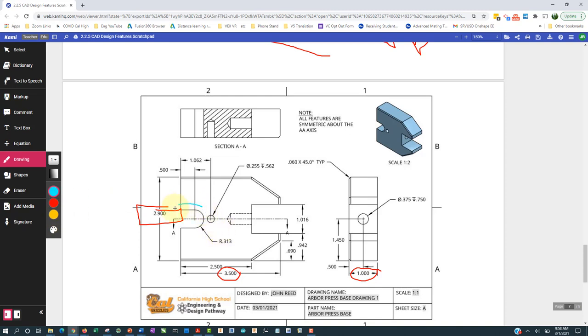I want to add this feature here and this feature here — those are just going to be simple extrusions — and then I'll go back and add the hole. So let's make these two in blue. The radius here: what I'm going to do is make a circle, then two lines, and trim part of the circle. I'll put a circle centered at 0.5 inches from this edge.